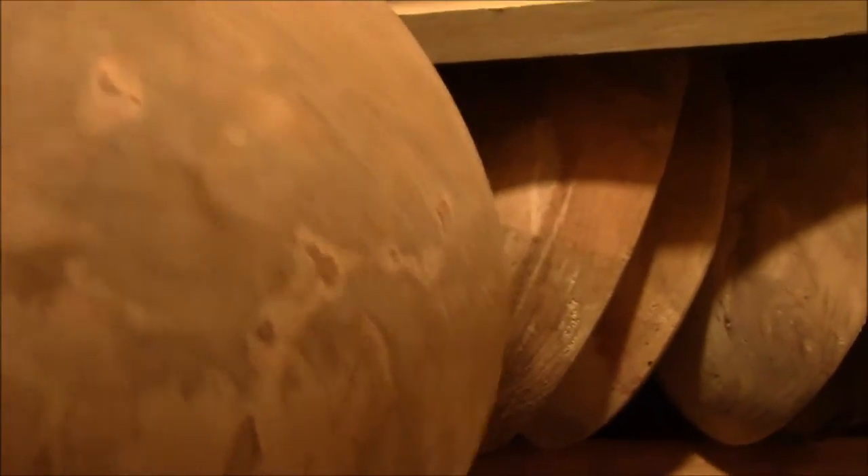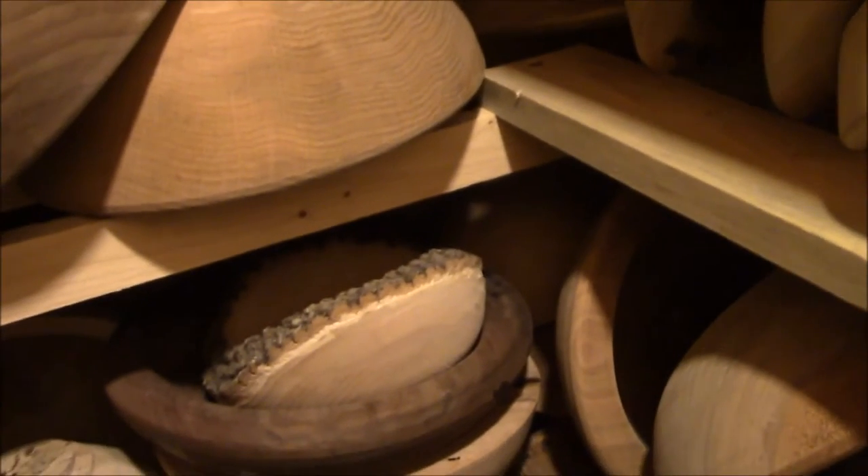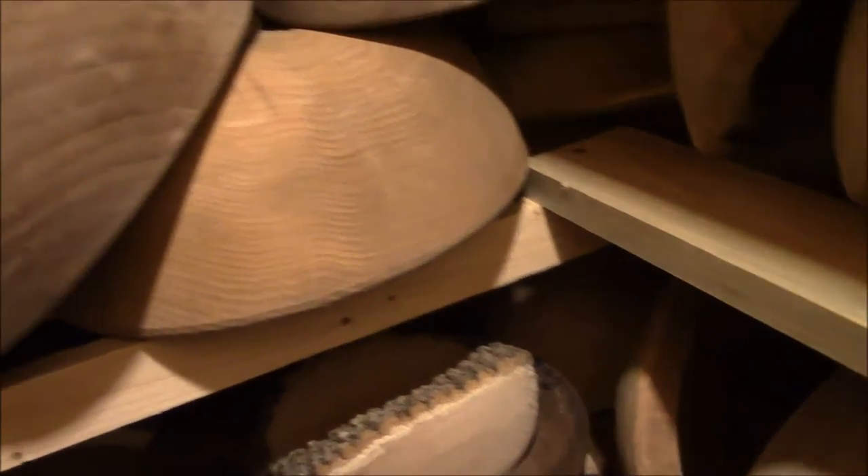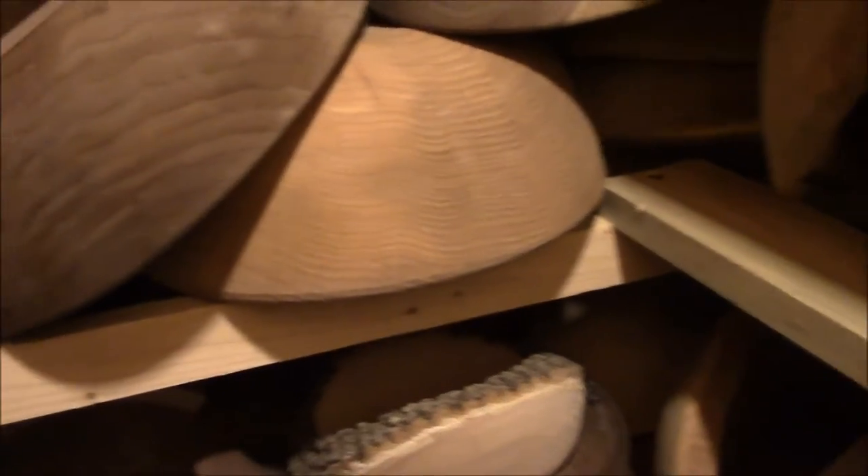You can see there's no checking on the end grains on this particular one. I'm getting about 70 to 80 percent like this, which to me is pretty good. I've tried the old sawdust-in-the-bag method, wait a year — and that works. I'm just saying sometimes I want to get stuff quicker than that, maybe a special order, so I had to come up with some other way to do it.